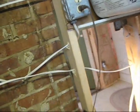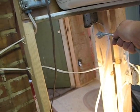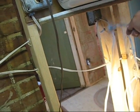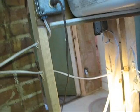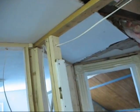Of course, I'm going to need to plug it in, so I needed to wire a switch. I was originally going to wire my switch right over in here, and I realized at a certain point that there was nothing hot that stayed hot in here. All this stuff is working off the two-way switches that light the stairs. But I had a hot wire that came down on the other side of that door that I was planning to use to run the electricity along that wall.